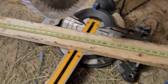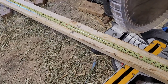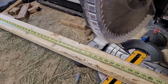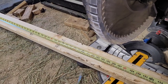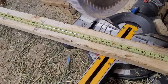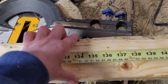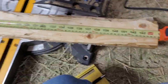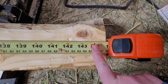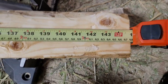So this is a 12-foot 2x4. For those of you new to woodworking, whenever you buy lumber it'll be labeled with a measurement like a 2x4, 4x4, or 1x8 — but the wood always shrinks from that, so that's not the true size. Every side will have a little less than an inch. So this, for instance, is the 2-side — it's actually one and a half inches. This is the 4-side — it's actually three and a half inches. The only part that should be true is the length, but there's actually almost a full extra inch here — so it's not actually 12 feet. Worth noting.